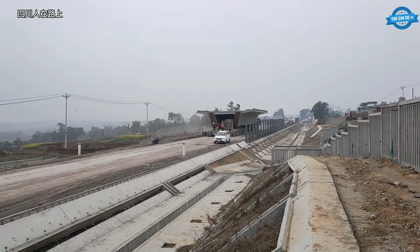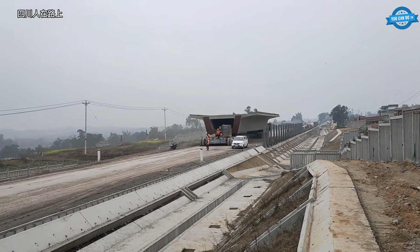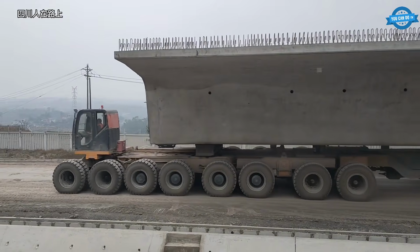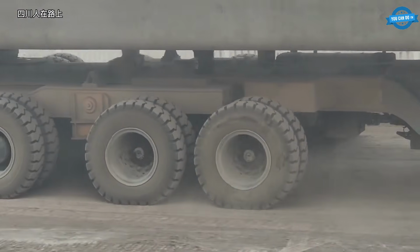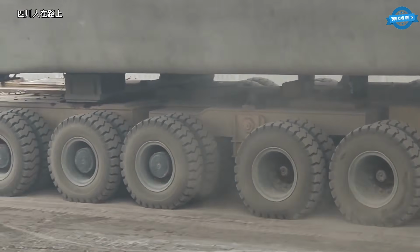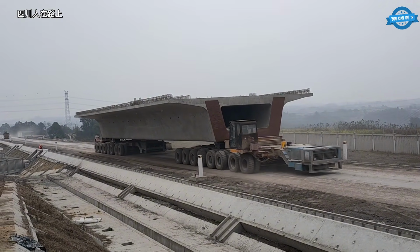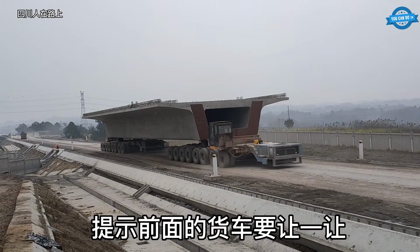But the launching gantry is only as fast as its supply line, and that supply line runs across the already finished viaduct. The transporter carrying an 800-ton span rolls at 4 to 5 km/h, using the completed deck as its highway. The road on top of the finished spans is barely wide enough for the transporter itself. 2 operators run the coupled units, one front, one rear.